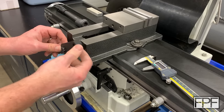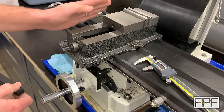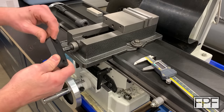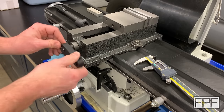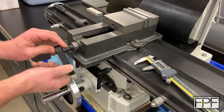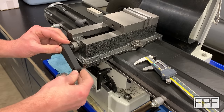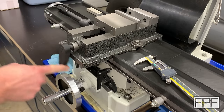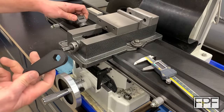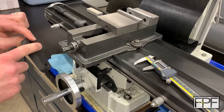We're hitting — this actually hits against this. Apparently the back of the hex is further out than the front edge of the vise, so we'll have to add a ridge or shoulder here to keep it away. If we target our speed wrench being more or less flush with the front of the hex, that should give us clearance back here. Even just the experience of spinning it with my finger is so much better than trying to use the original handle — I could almost stop here, but I'm not going to. We need to make some design changes.